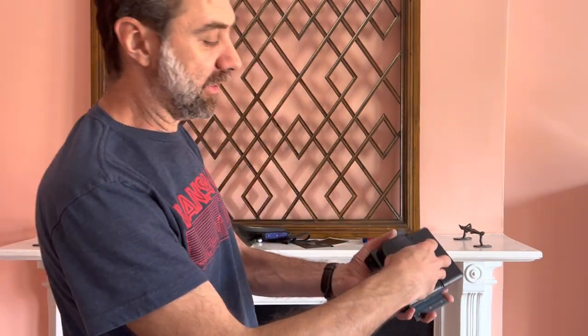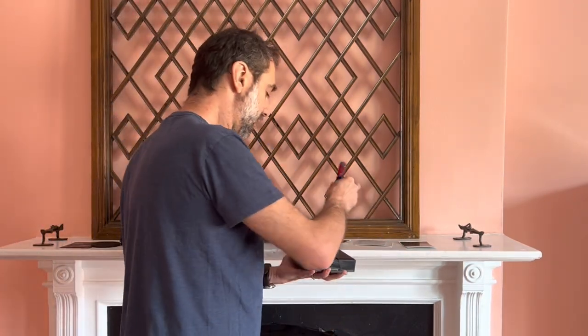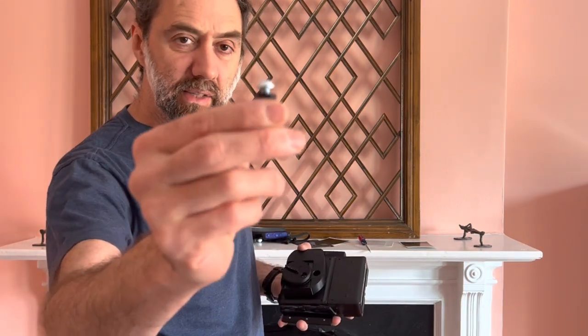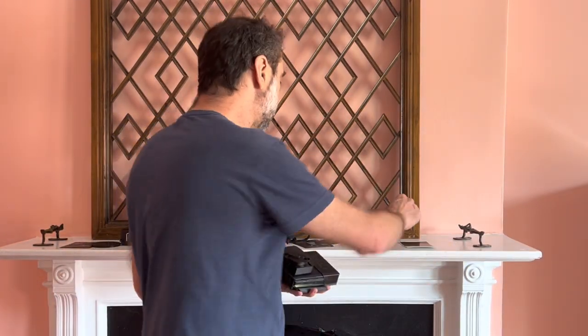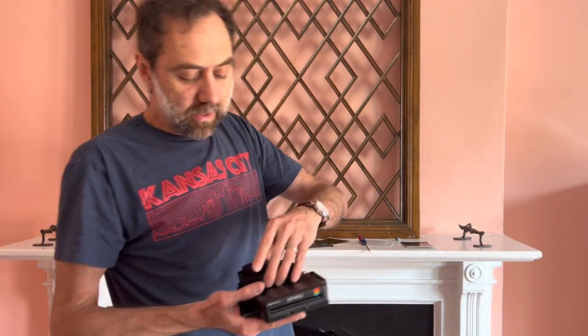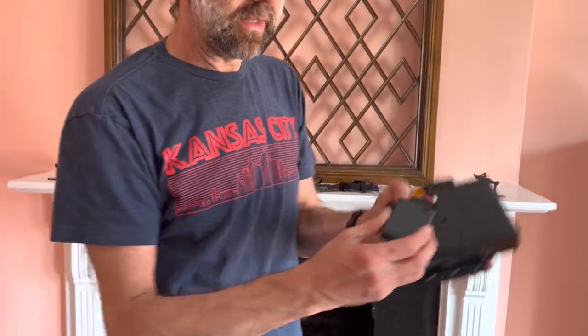Well, I will turn this off first, actually. So there's a little switch that turns it off. Unscrew this. The screw has a little plastic washer. I sometimes glue this. Actually, for the ones I'm selling, it's glued, it shouldn't come off, but if it comes off, make sure you don't lose the plastic washer. Put the screw aside, and remove the cover. It's probably going to come off. Oh, look. Like this, and it exposes the battery pack behind it.